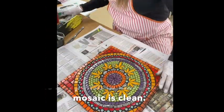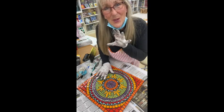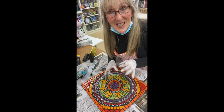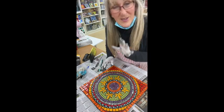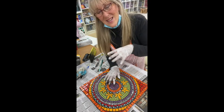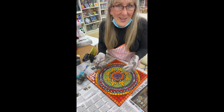Now I get a clean cloth to polish this up. The last thing is another check over the whole piece — I rotate it around to make sure I haven't missed anything. When you look at it from different angles you will see things you didn't see the other way. You need to do all of this now, because this grout is going to dry rock hard with the additive in it — very firm. I won't be able to go back into it in half an hour. Tomorrow I can go over it with methylated spirits to give it a lovely little buff.